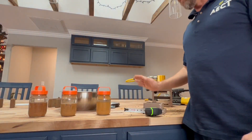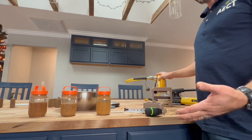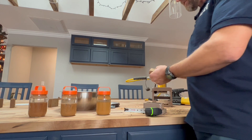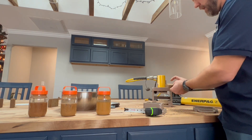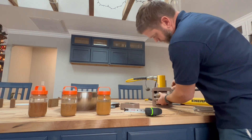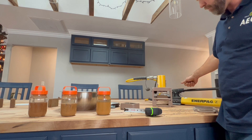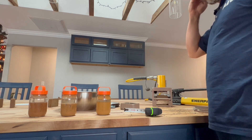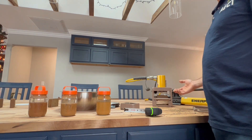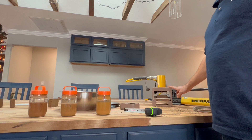The next step is to put some of this soil sample in our small block press and make a sample block — first to see if it's got enough binder, then a week from now we'll pressure test it by bringing the piston down and reading the pressure gauge. It's typically over a thousand psi, sometimes up to 2,000 psi. Anything over 300 psi is viable, a decent block, so we'll be interested to see what this soil does on the compression test.